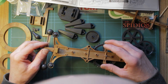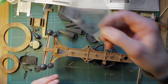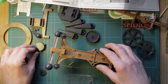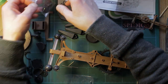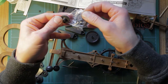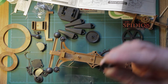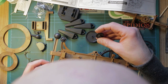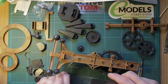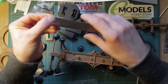We need a 31 millimeter shaft, not a hex shaft, so it's one of the round ones. A jig for assembly. Where's the jig for assembly? Jig, here it is. Here's some gears in a little plastic bag. Jig for assembly looks like a button, and it says on it, jig, so you cannot confuse it for a part, which is good. That is used for the assembly of gear D5, which uses the 31mm shaft, so we get our handy steel rule, and we measure to check that this is indeed a 31mm shaft, which it is.